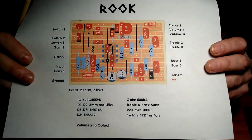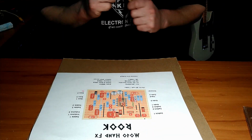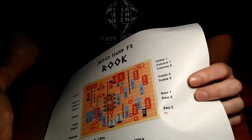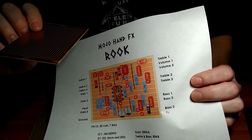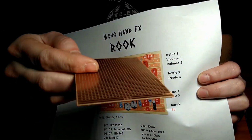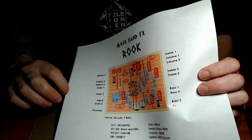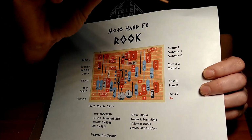And we found this on the old internet and put a link in the description. And it shows us what we need to do. So there's nothing left to do but to do it. So let's do it. Okay, so first little tip here. As you can see by the drawing, it looks like the components go down this way into it, and it looks like it's lined up like this, but you need to solder on this side. So the components are going to be pushed in from this side and soldered on the side with the copper traces. So, you know, it's a little confusing for a first timer if you're looking at this, but solder will not stick to this unless you're very, very good.